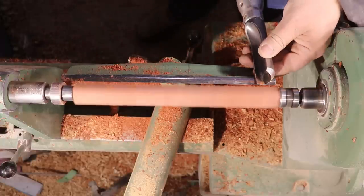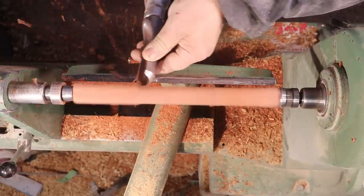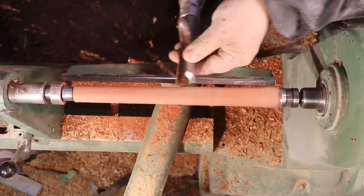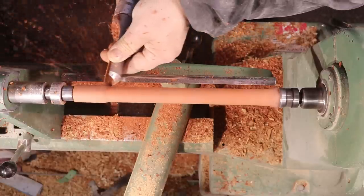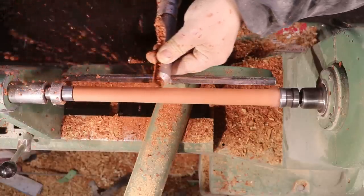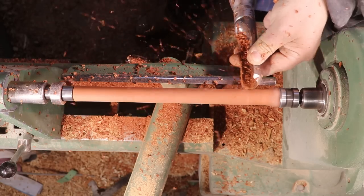This is a piece of quarter-inch square by 12-inch long padauk, and I turned the stem out of that. I needed to make sure I turned it down small enough to match the bottom of the leaves as I showed earlier. I put a little flat spot on it, and I wound up just touching the bottom of the flower itself on my belt sander to leave a flat round circle on the bottom of it.